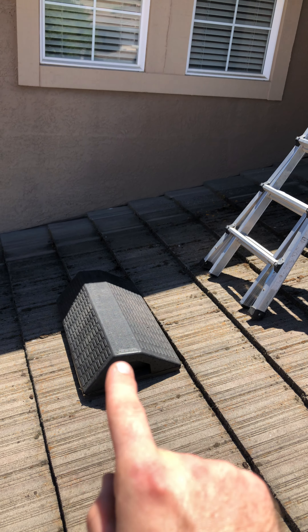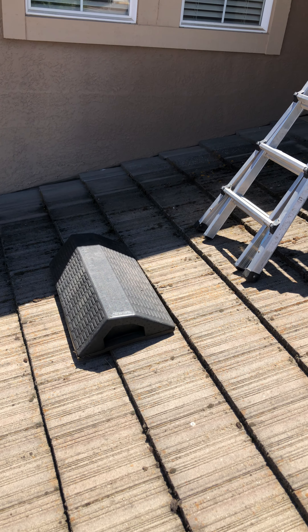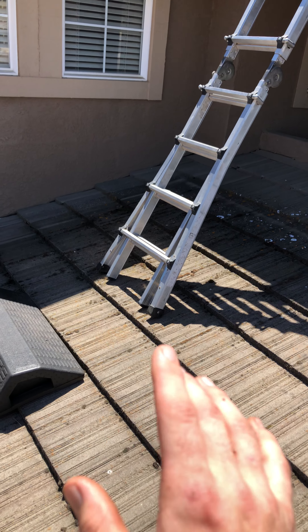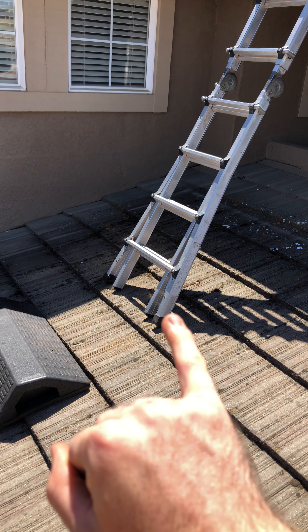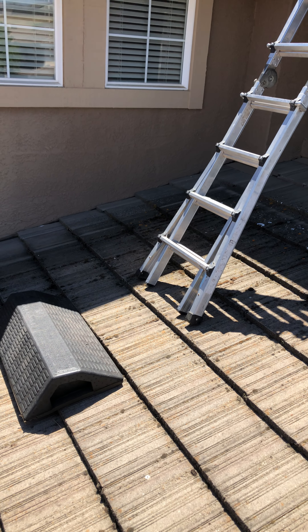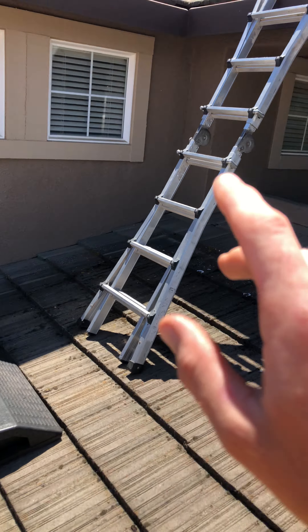One person is going to be positioned on the pitch hopper — both legs kneeling on the pitch hopper so that it secures it to the surface — and their arms are going to be grabbing both sides, both legs of the ladder, the right and the left leg. The second person is going to set the ladder just like normal. That's how the process works — you're going to work with a two-man crew to ascend a ladder to the second story.